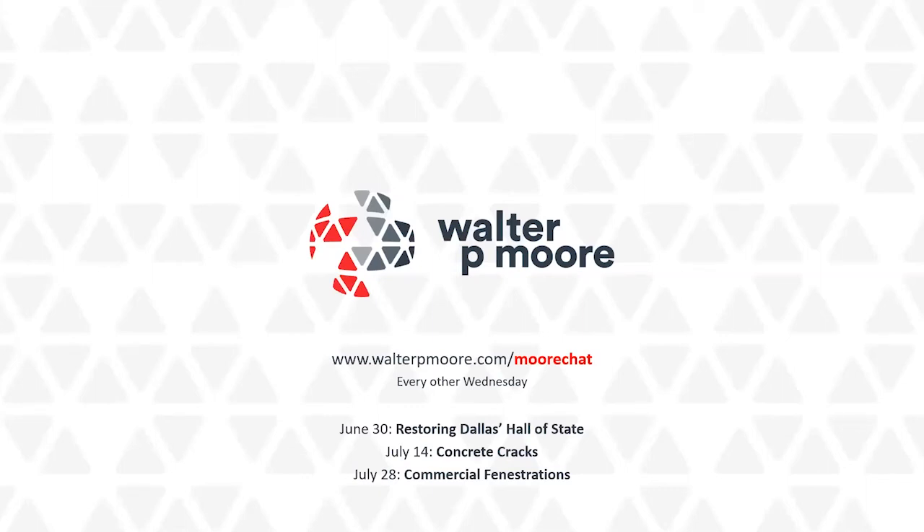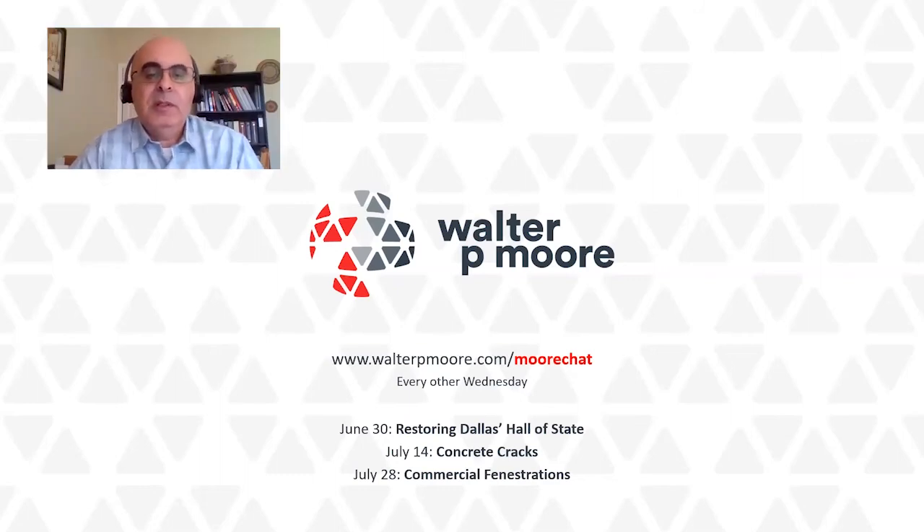Thank you for that, Hakeem — that was really interesting, certainly something I hadn't thought about before. I did have a question: you talked about mill buildings, so what kind of building length or size makes it important to consider temperature loads? Is it any building or a specific size? Based on the thermal changes we see and the type of frame, generally we start at 400 feet where we should start paying attention. Less than that, those forces may not be large enough to impact the building's behavior, but at 400 or maybe even 300 feet, it's important to start looking into that.